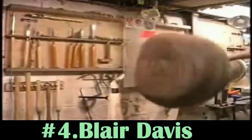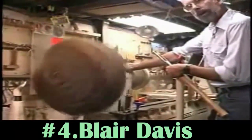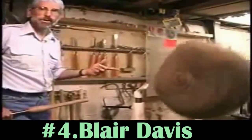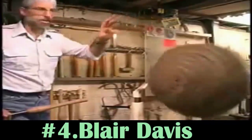What I often do is just put my hand on the lathe and sort of feel it, and then I'll bring the speed up until I feel it start to rock a little bit, and I know I'm starting to get some vibration. Then we'll just stop there. As you turn the piece, each chip that you take off brings the piece more into balance. So as you turn, you're getting it more and more in balance, and at the same time you can gradually bring the speed up.